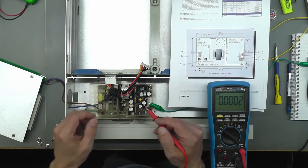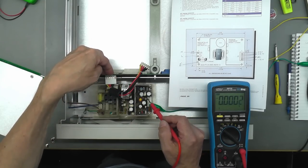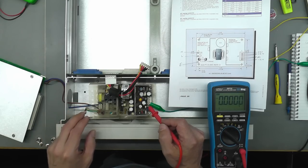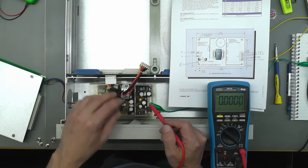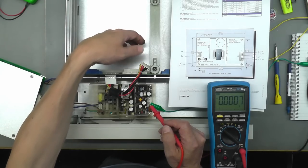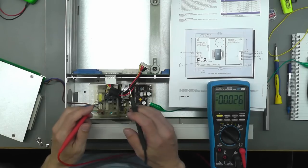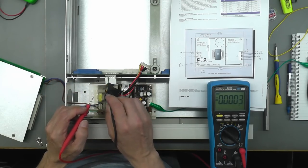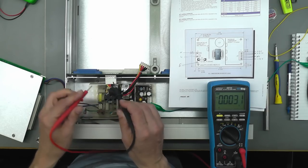As I mentioned at the start of this video, this is the DC output here that comes up this cable directly onto the backplane. Remembering there is a permanent AC input onto the power supply at all times. And it looks like the power switch on the front of the unit is actually probably switching the DC outputs. Maybe the plus 5 volts is switched by a couple of the semiconductors on the actual backplane. So I've got power removed at the moment. What I think I will do now is just check the resistances across the DC power going onto this backplane. Let's see if we've got any dead shorts or anything.